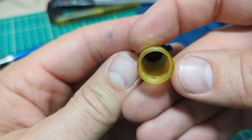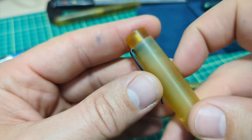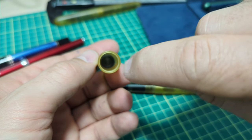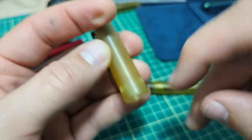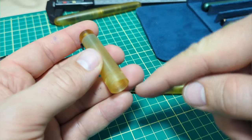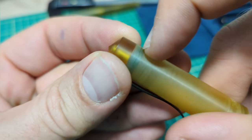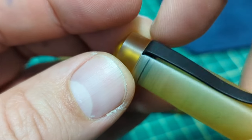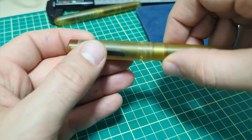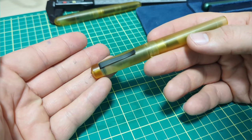To show you how it seals: there's a little black disc down in there, I think made of Delrin, which is a really cool plastic. Your clip goes into the cap, and there's a screw behind that disc in a threaded hole — a little screw holds the clip in place, retained by that disc. To ensure no leaking through there, there's a black Delrin disc with an O-ring — that little black line going all the way around is what seals the chamber of the cap from the outside world so the ink doesn't dry up. It's a super simple solution and done quite well, and the pen doesn't dry up on me either.